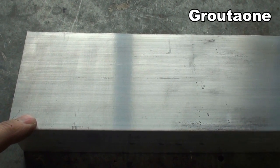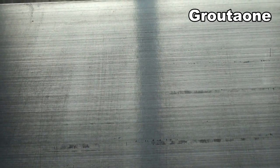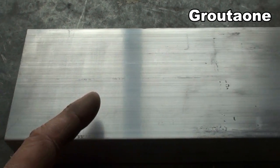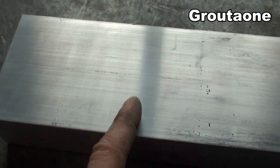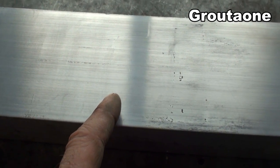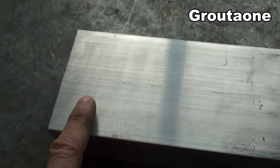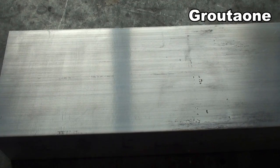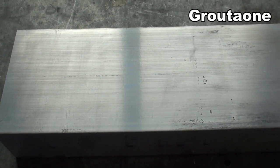What happens if I don't sand this prior to polishing? You can see all the little fine lines on the surface from the manufacturing process. So I'm going to have a spot where I don't sand it at all, then an area where I sand with 320, then another area where after 320 I also sand with 400, and then an area that also gets 600. I'll have different areas of prep and then I'm going to compare them all — same polishing treatment, different prep.